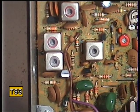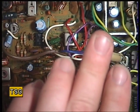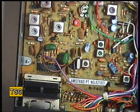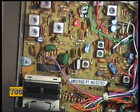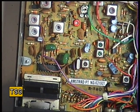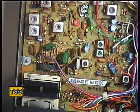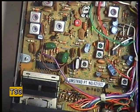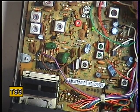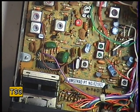So we need to back off the squelch and find the preset — just lurking down there. I'll zoom out so you can see it. Now we'll run that test again: signal generator off, squelch to minimum, advance squelch to threshold, switch the generator back on — coming in at 0.3 of a microvolt. Turn the squelch to full and that's coming in at 30 microvolts. I'd actually like it coarser than that, so we'll try again. We'll advance that control and clean it, just in case — that can be one of the problems. It's a bit of a faff doing this, but you want it to be right or it's very frustrating.